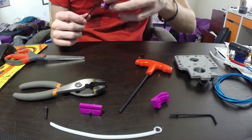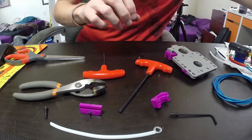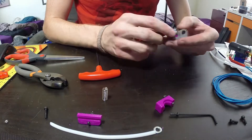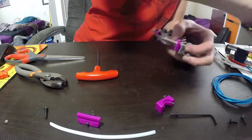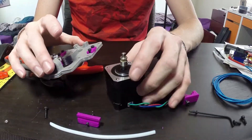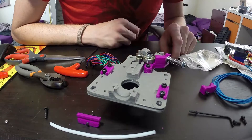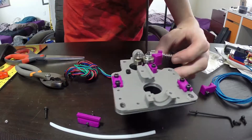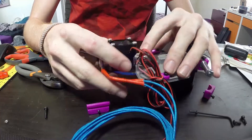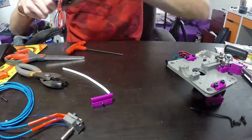These all need M3 nuts in the back end. You can see all of the holes in the back of that face plate that all the screws will screw into. You've got the compression spring to keep everything in good tension on the extruder arm. Then you've got the extruder motor which slides right into the face plate with the gear in — just line up the teeth on the gear with the face of the bearing. Screw the motor in. One of the screws on the lever actually goes all the way through the lever into the motor, so make sure you get the right screw for that.